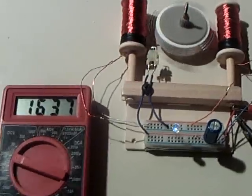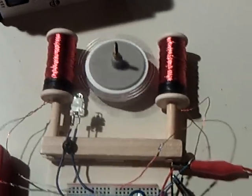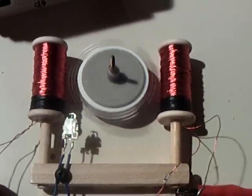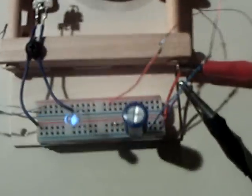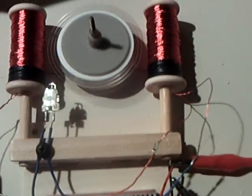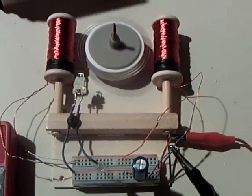That's my little experiment for tonight. I had it charged up with a couple of AA batteries — here's what the gallop sounds like. I learned that from Laser Saber's Easy Spin: because my rotor is not perfect and it wobbles — and so does his — you can put these into this galloping kind of mode. It's like a hit-and-miss internal combustion engine, and they do this really weird firing-and-generating, firing-and-generating kind of deal. It shows up as a really low amp draw.